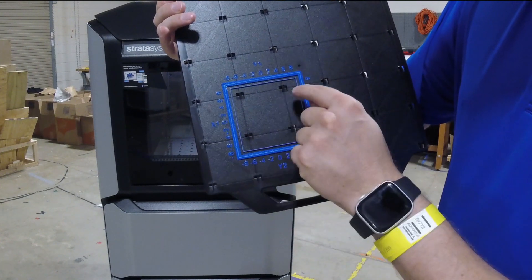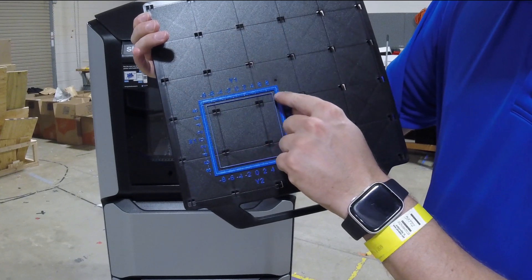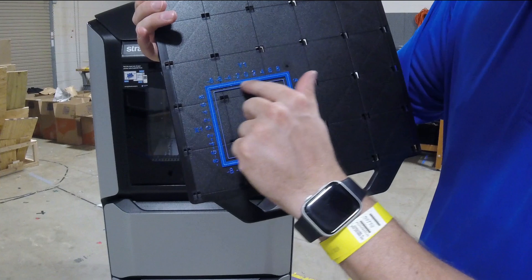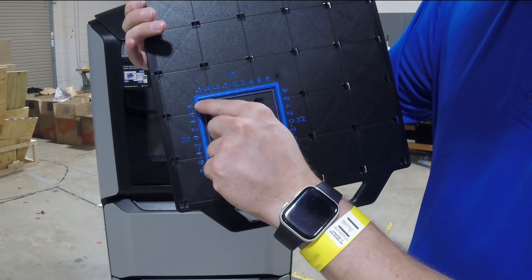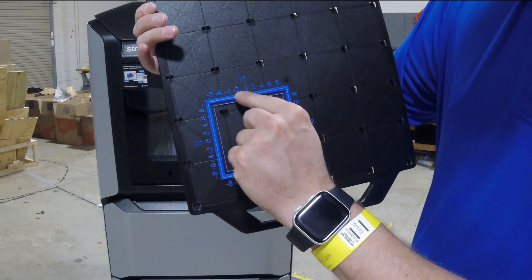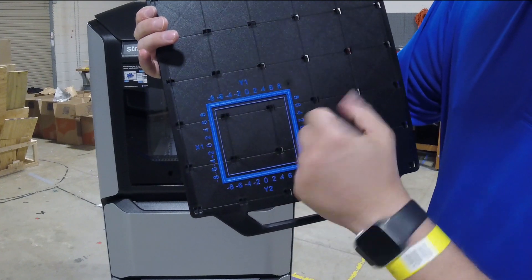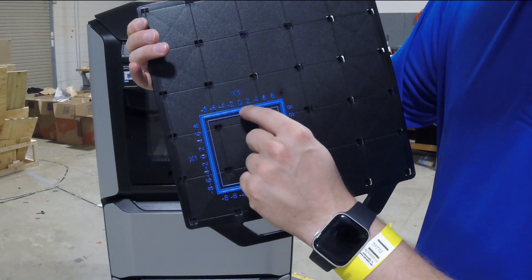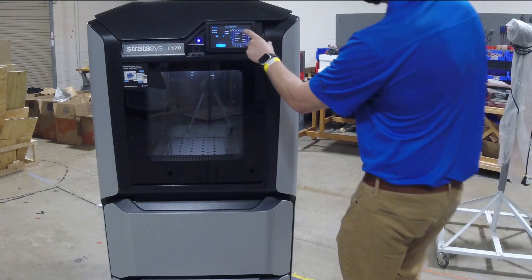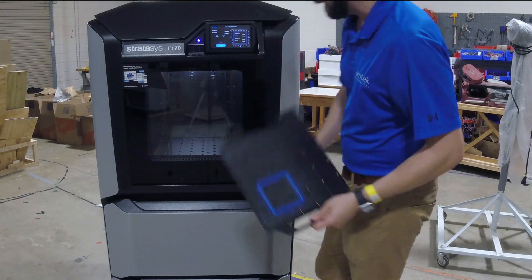We need to use our fingers to select the appropriate offset — we've got Y1, X2, Y2, X1, and negative 8 to positive 8 on all sides. This is where printing in blue or a different color than white comes in handy, because the support material is white and the base is blue. What we have are two sets of dashed lines on the top and sides of the white line. That white line comes either up or from one side at an angle, and we want to find the area where it's best centered between the two dashed lines and note the corresponding number. Working from negative 8 to positive 8, find where it's best centered — for example, if it's centered at negative 4, we slide our finger to negative 4. We repeat that process for all four sides and then hit the Apply button.